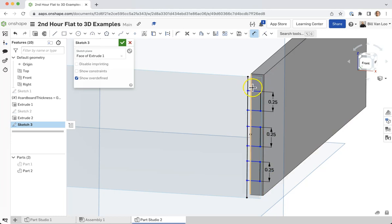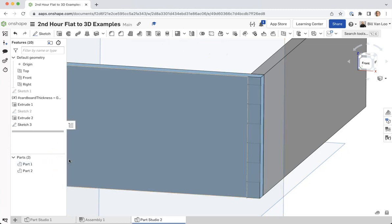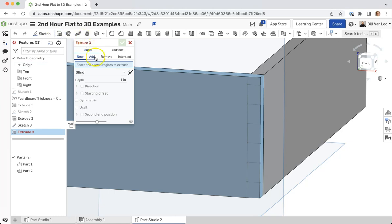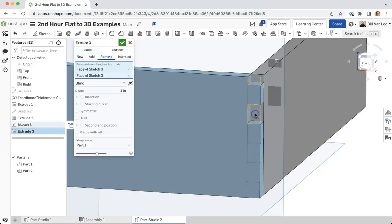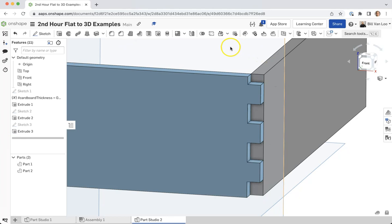Maybe I want the spacing in between those to be 0.25 as well, so I get a pretty nice neat spacing. I'll turn the visibility for this part back on. Now all I'm going to do is remove material from right here, right here, right here, and right here, and click the green check. Now you can start to see I've got those sections chopped away from this part, leaving just those fingers or tabs that stick out. That gets me half of my finger joint — my box joint.